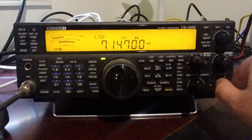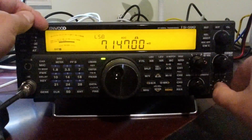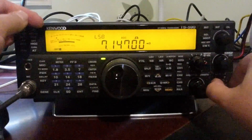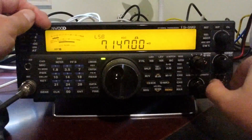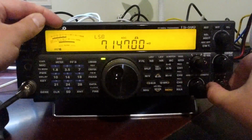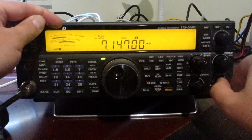We'll just confirm we've got a signal here — it's quite good quality. I'm only using this particular transmission as an example because it's got a strong reading on the S-meter. There's another partner here who you can barely hear. If you want to increase the signal-to-noise ratio on these receivers, what you do is dial back your RF gain. Adjust your volume for what you like, then dial back the RF gain and you'll find that the bars go solid on your S-meter. If I increase it even more you'll see it go solid at S9 — so what that's telling you is that you've dialed back your RF gain to the point that the AGC will only kick in when an S9 signal comes along.